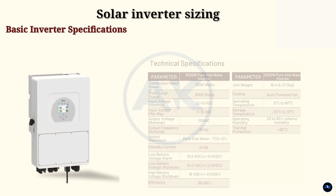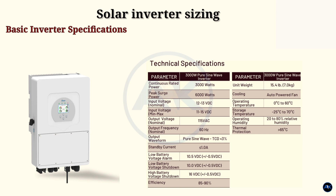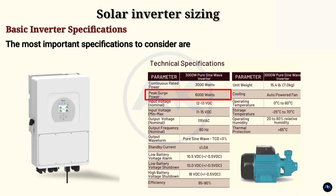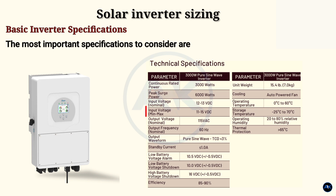Reading the datasheet or specifications of an inverter for the first time can be confusing. The most important specifications to consider are: 1. Power output — the maximum continuous power the inverter can supply. Exceeding this rating will cause the inverter to shut down; for example, a 3kW inverter has a power output of 3000W. 2. Peak output or surge power — the maximum power an inverter can deliver for a short time, important for appliances like refrigerators and compressors that require high power on startup; peak output is typically over double the rated output. 3. Input voltage range — the minimum and maximum input voltage at which the inverter will function. If voltage falls below the minimum startup voltage, the inverter will not switch on, and exceeding the maximum input voltage will cause the inverter to fail.